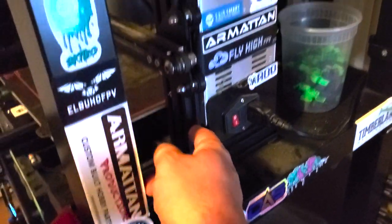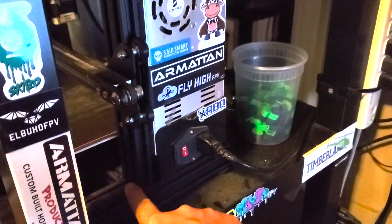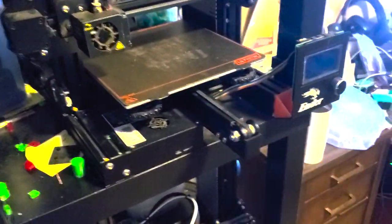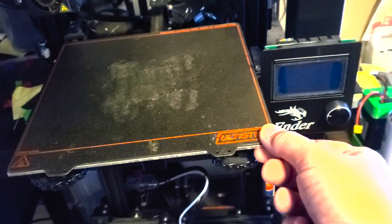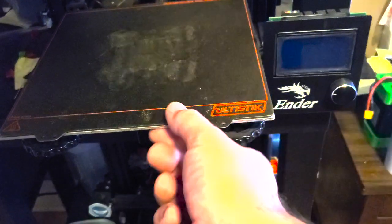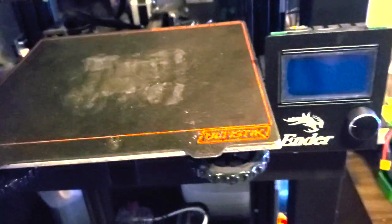And then up here, the uprights, same thing. You need to loosen them up, get them square, and then tighten them up again so that you know that your foundation is square and your house is stable and everything's gonna be good there. The next thing you wanna do is look at the bed and make sure that there's not any wiggle in here. If I just give it a little wiggle back and forth, this bed is locked on, it's not sliding anywhere. And the reason why is because underneath this bed is all these rollers.